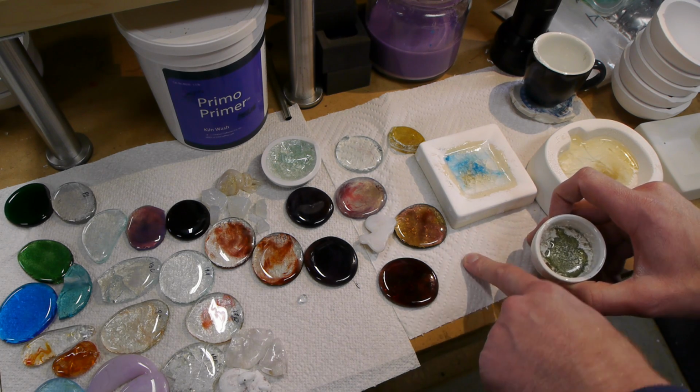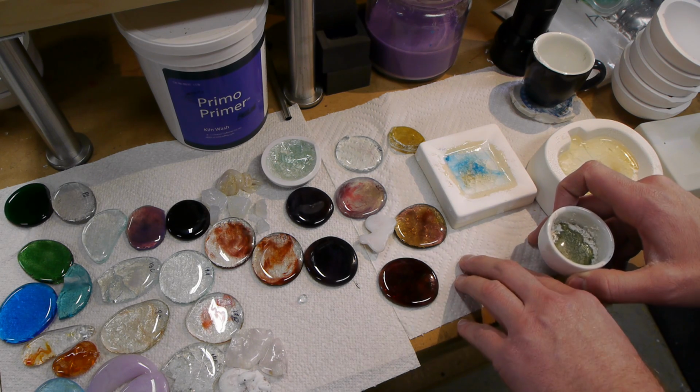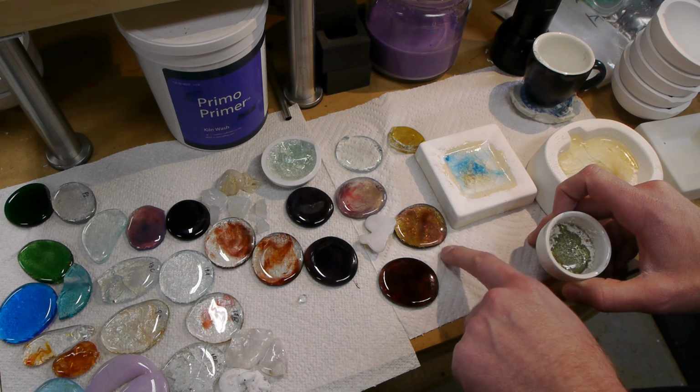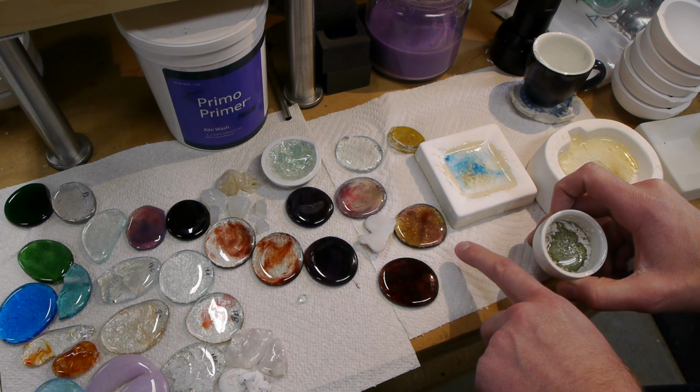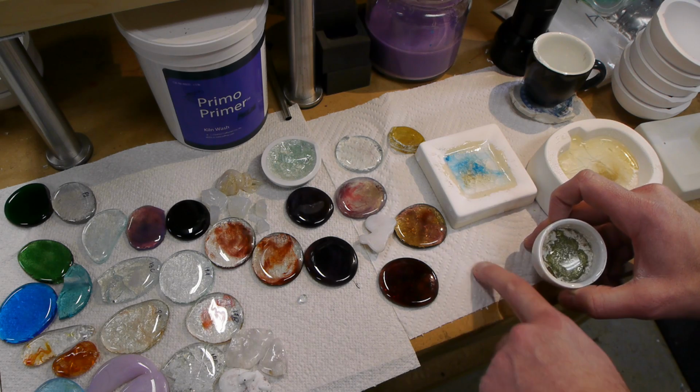And it really doesn't like hanging out in a hot hydrogen environment because it actually prevents the glass from being photochromic. So this can only be formed in crucibles or in oxidizing environments. You can't use the float glass process for this.